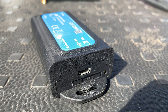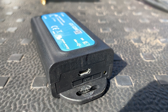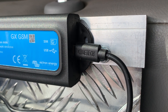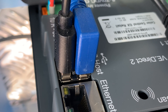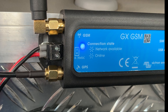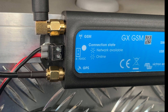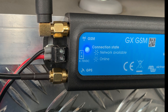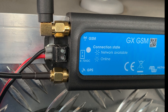The GPS unit has been connected to the modem side and a standard size active SIM has been inserted. The USB has been connected to the Color Control GX, and finally the power connectors have been wired in via the included fuse. When powering up, the blue LED will display as a solid light. Once it has registered on a network it will start blinking slowly, and once it has established the internet connection it will blink fast.